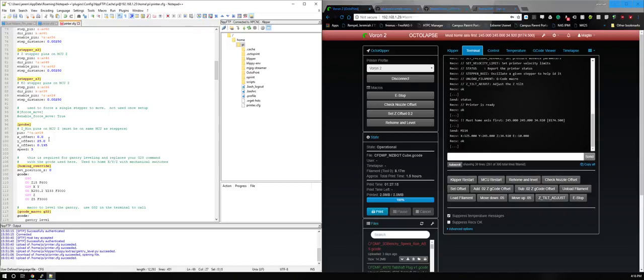back to what I was getting at, I have my probe hooked up on the Z-min pin on my MCU-Z end stop. And then these are just the offsets that are applied to that. I see a 0.195 sensing distance from my bed. The inductive probe is 25 millimeters positive away from the nozzle. And I probe at 5 millimeters a second. That's what the speed here is.